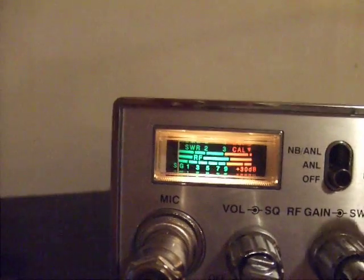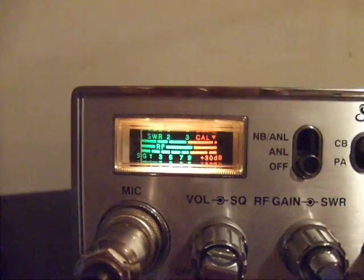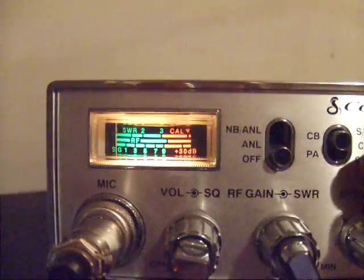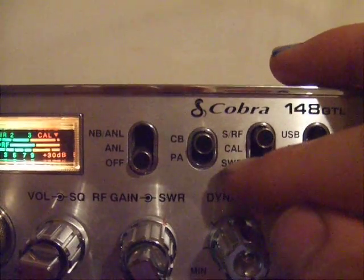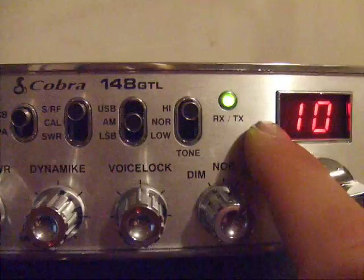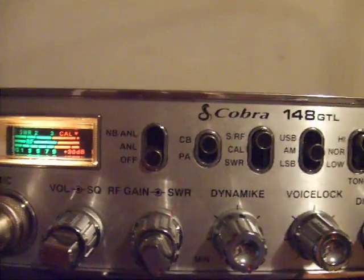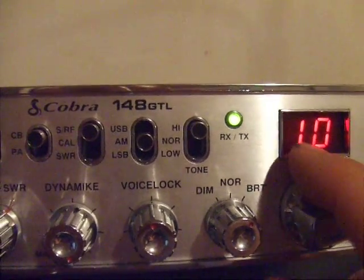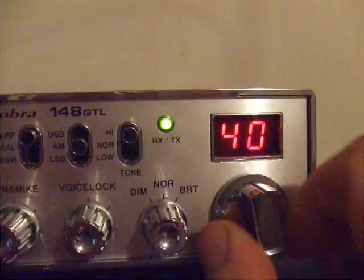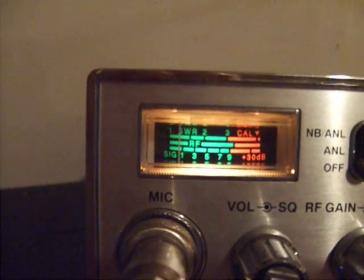Now that we've calibrated and know the standing wave is low, put this back on SRF and you're ready to transmit. When you're calibrating and doing your standing wave check, keying down will still transmit that signal, so be aware of that. If there are people on the channel you normally use, you might want to go one channel up or down — it won't affect your reading that much. Now if I go to channel 40 and do a standing wave reading, you'll notice my standing wave is a little bit higher.